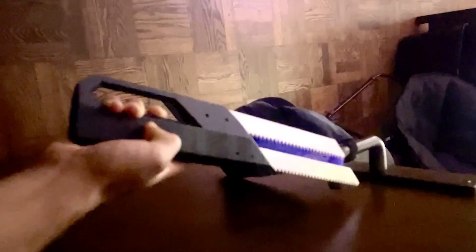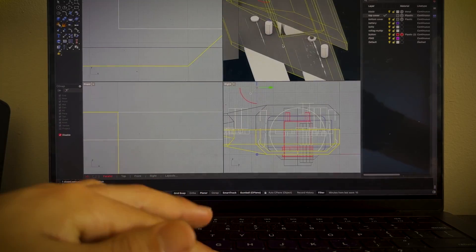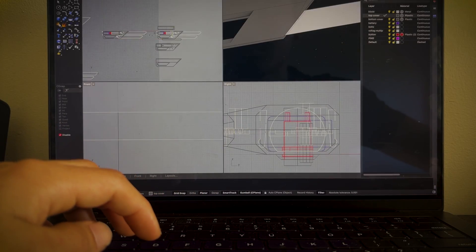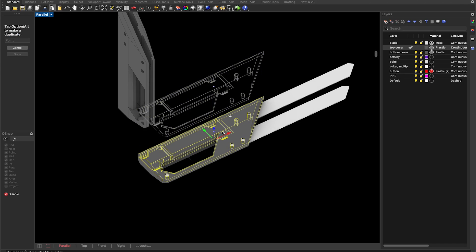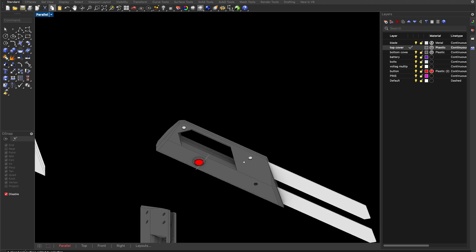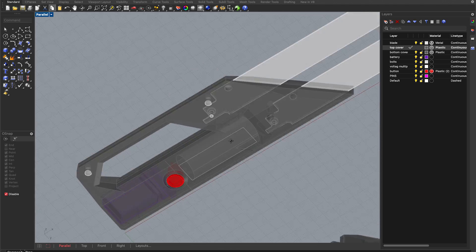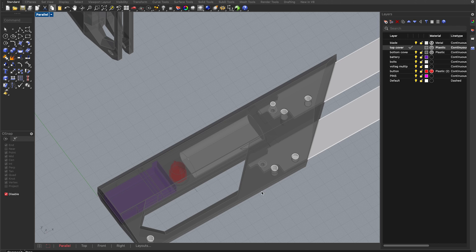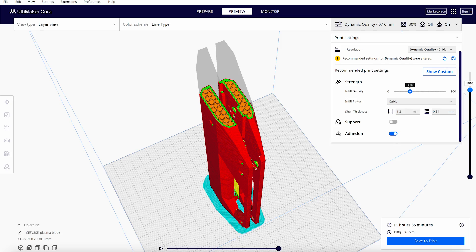This design fit the sleek sci-fi aesthetic I was looking for. However there were still minor problems with the handle design, so I continued 3D modeling and upgrading every single part to make sure it was perfect. The 45-degree angles on this design are actually functional — they eliminate the need for support material when printing, so making this produces zero waste. And now it's finally time for the final assembly montage.